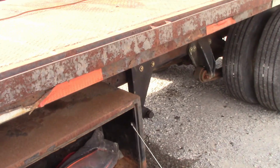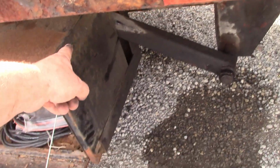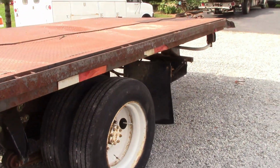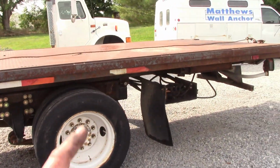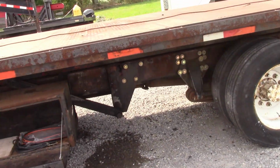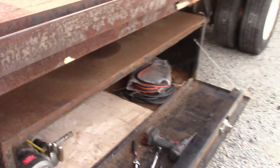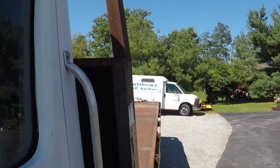He's going to take care of these. You need a couple spacers in here so those arms don't come down and hit the toolboxes. He's going to take care of that. The bed works. It functions. No hydraulic leaks anywhere. Even the ram back here that was leaking, quit leaking. And doing pretty good. So he's gonna find me a pressure switch. I'm gonna put that on real quick, and that's gonna be the end of this one. He'll be off and running.